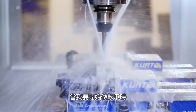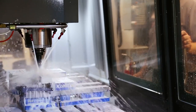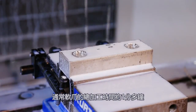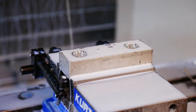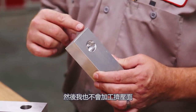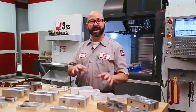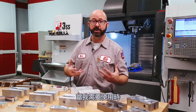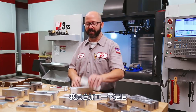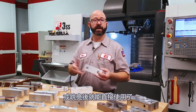We'll start by making some jaws. Whenever I had a slow day at the shop or needed some busy work to keep my guys going, I'd have them make jaws. These are a machinist's best friend. The cycle time on these jaws is just over a minute and uses only three tools. I'll leave the ends saw cut and won't even machine off the extruded faces. By keeping them cheap, I'm able to make more of them. I'll just file the edges, give them a quick deburr, throw them in the tumbler or scotch bright them and we're ready to go.